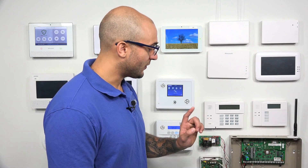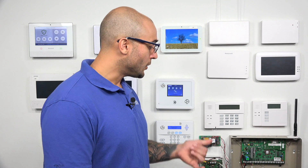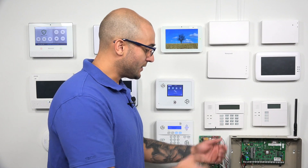Another thing you can do is if the power wire that provides AC or DC power to your main wired system works, you can continue to use that wire. You just have to undo the transformer at one end of it, take it off of your main alarm system, connect it to your 5800C2W, and connect the 5800C2W's transformer to the other end of that power cable, and it will be able to provide power.